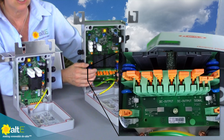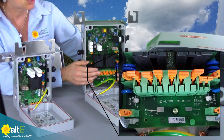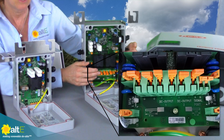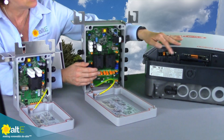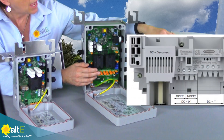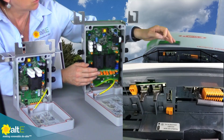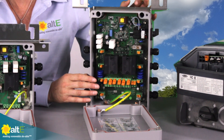You'll also have your grounds and your signal wire, and all of that can go in the same conduit down into the inverter. The DC wires connect to the DC connecting area and the signal wire goes to the communication area of the inverter. It's a very simple system.